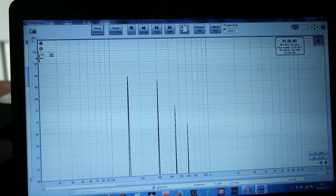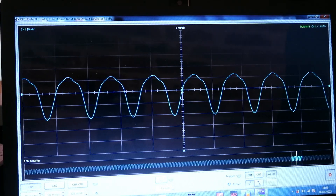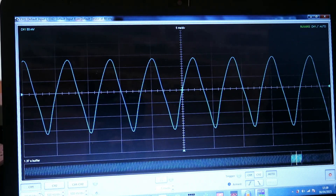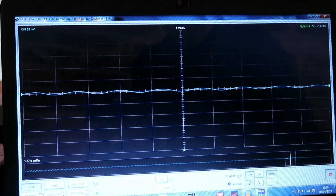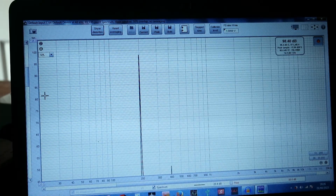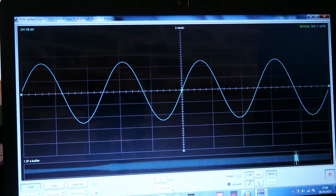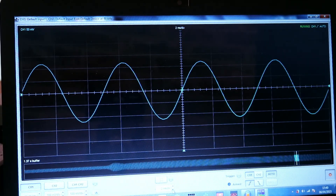As expected down at 150 Hz, there are tons of harmonic distortions on the top half of the sine wave specifically. Blocking off the right-hand port cleans up the shape a fair bit — still doesn't look great but definitely improves it. When we block off the left-hand port, not only do we get a massive boost in output but it hugely cleans up the sine wave shape as well — it looks a bit triangular and spiky but way cleaner than with the ports open. At 198 Hz, this is beautiful: a super nice clean-looking sine wave even up to really high levels, and very loud. Nothing visible about this sine wave I can comment on — it looks almost perfect. Blocking off the right-hand port almost completely kills all output and distorts the waveform. Blocking the left-hand port, we lose about half the output.